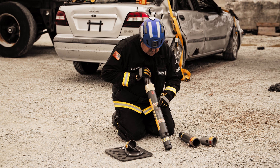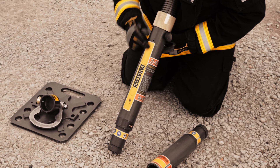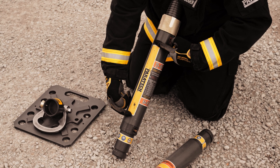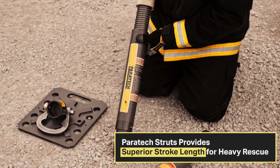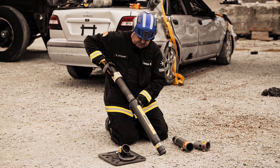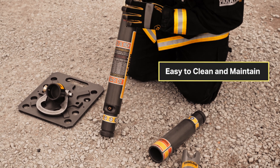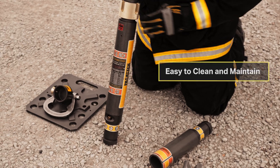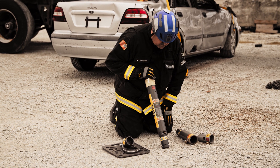The label shows all the capacities of the strut at 2-to-1 or 4-to-1. If you look at the yellow stripe on the side, the length of that stripe tells you the length of adjustment available in the Acme strut. It also has relief holes on top so we don't over-pressurize and blow out the air chuck.